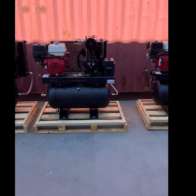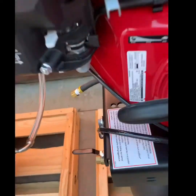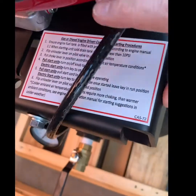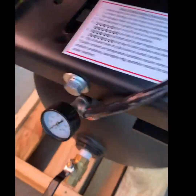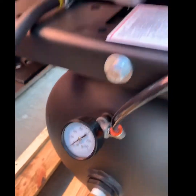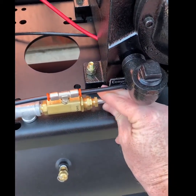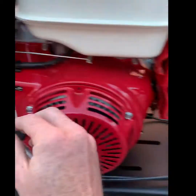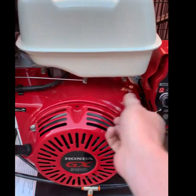We will now use the electric start feature connected to a battery that is mounted to the compressor. Starting procedures are listed on the compressor package. Make sure your tank pressure when starting cold is below 10 psi or 50 psi when starting warm. Unload the compressor package, set your choke appropriately, and engage the electric start feature.